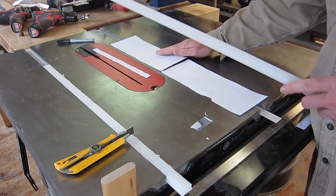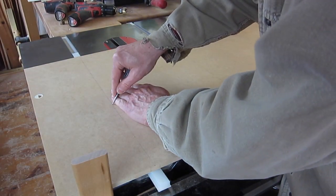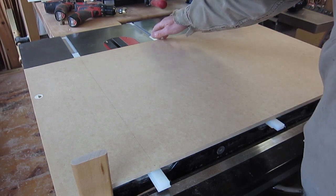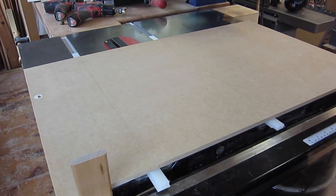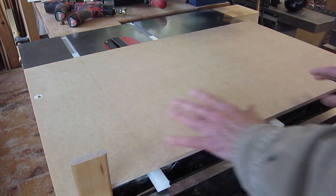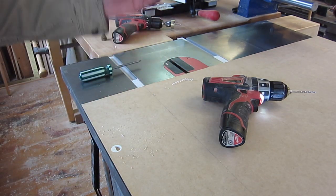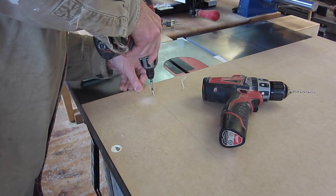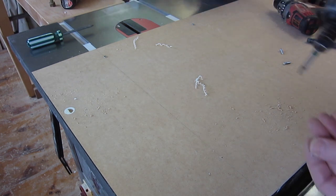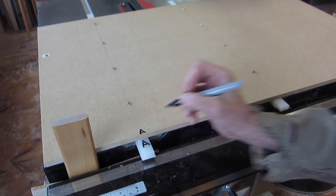There's the base with center lines on the strips, and I'll punch where I want the screws to go. I've stayed quite far away from the edges because there'll be a fence at the front and back, and I don't want a screw head buried under the fence in case I ever have to change the rails. I've also got stops wedged into the table saw, and this board is registered up against it so it doesn't move and stays parallel. I've drilled straight through the base and the slider so the holes are perfectly lined up, and I'll put a screw in temporarily to hold that. I'm putting the rest of the screws in — drilling one hole, putting the screw in as I go — so the screws help keep everything registered. Now I'll label these, because that's important.